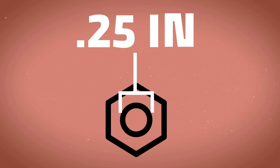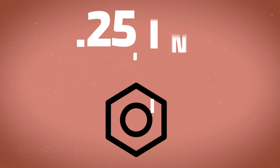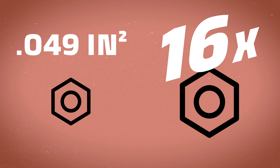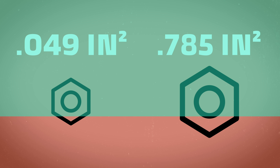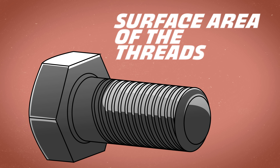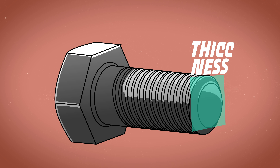Well, let me explain. When you're buying bolts, they're measured in diameter — and diameter is a one-dimensional measurement. But to calculate tensile strength, you need a two-dimensional measurement. A one-inch diameter circle is 16 times the area of a quarter-inch diameter circle. So we would have needed over 2,200 pound-feet of torque to break that bolt. But the math doesn't end there, because the area we use for the calculation isn't the flat end of the bolt — it's the surface area of the threads. That area is partially determined by the thickness of the bolt, but also by the thread pitch and depth. With a larger bolt, you also have a larger nut, and the amount of threads contacting within that nut increases the surface area and spreads out that force. Even a minor increase in bolt diameter, thread length, or thread pitch can really change the amount of torque a bolt can take.